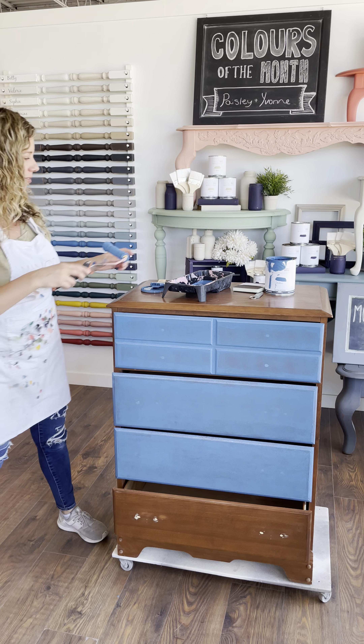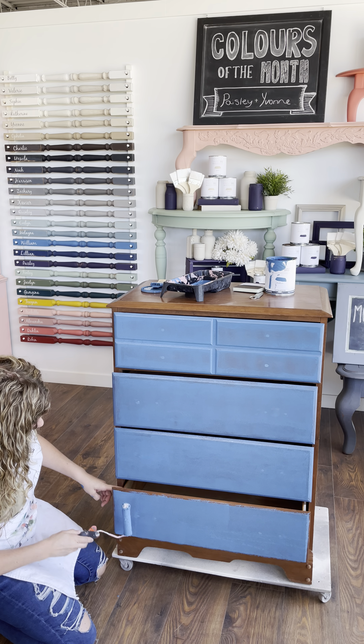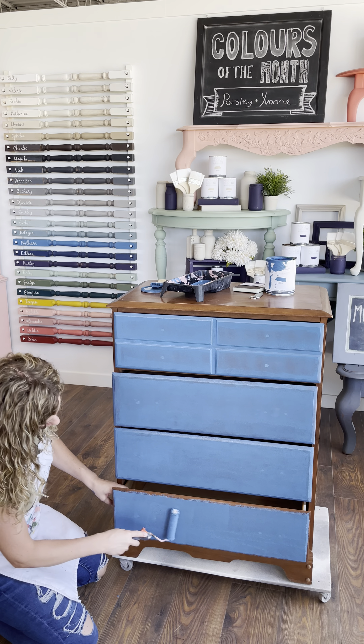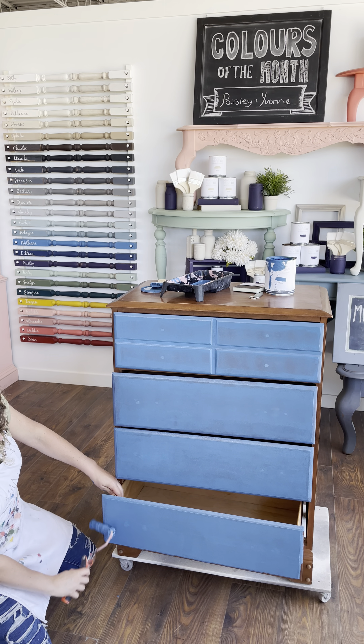Every time I load my roller I'm offloading on that little offload area, making sure my paint's nice and even. The key with the roller is a really light pressure — I'm not pressing very hard. You see, if I press hard it kind of drags and gives you marks, or if you have paint pulled up on the end it will smear. So not to worry — just a nice light pressure and you can go right over any issues like that.